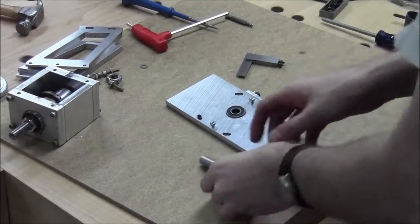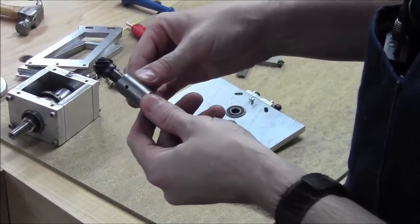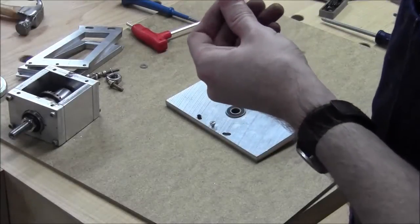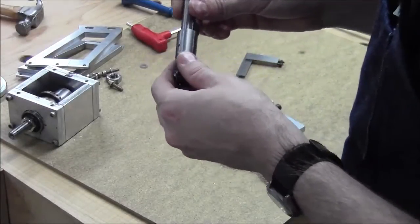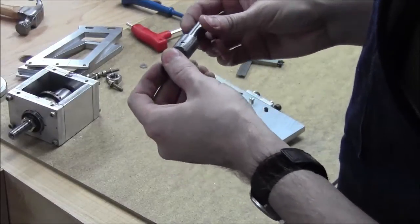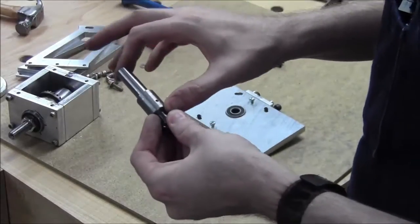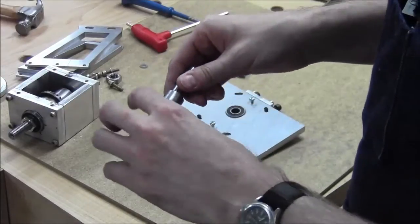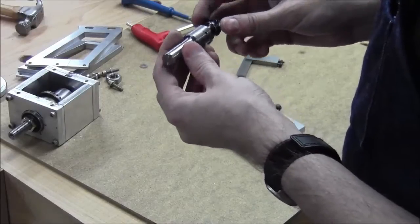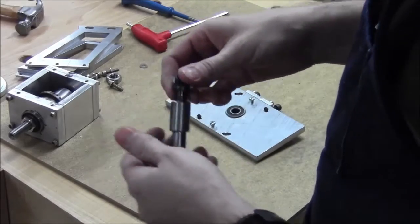We drilled and we've now got our roll pin down inside here. That'll hold this spindle on here to let me hook it up to the router. I'm not sure how strong this needs to be or whether this will be strong enough, but I think it'll be fine. I kind of want this area to be my failure point to sort of save the gears if need be — my amateur, not-an-engineer brain says this should be okay. We'll find out.